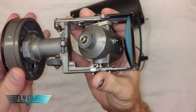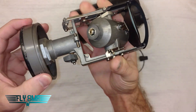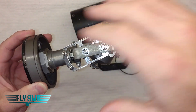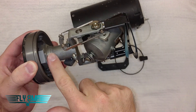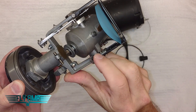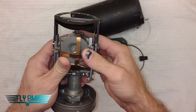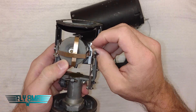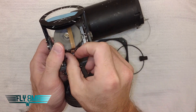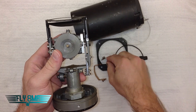Taking a closer look: we have air flowing in through here with vacuum pressure suction. This entire instrument is under suction — air is being pulled out of the instrument, coming in through here, through this arm, into the little gyro housing. If we rotate that over and remove these little limiters, we can take a look at the actual gyro inside the instrument.